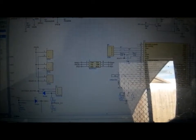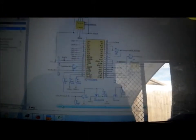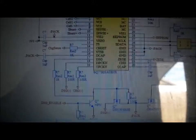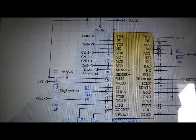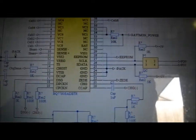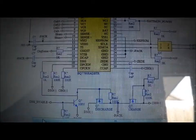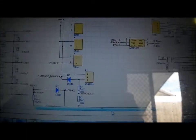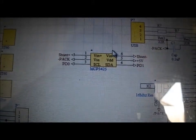What I've been working on is the circuit diagram. This circuit is going to be a sort of interface between the motor controller and the batteries, because the batteries don't have their own inbuilt over- and under-voltage protection. I have to do it manually, so I'm using this Texas Instruments battery protection chip, which has inputs for all the lithium cells and a shunt input for over-current. It's got an I2C interface for programming. I also have a 16-bit differential ADC that'll connect to the shunt.